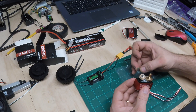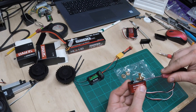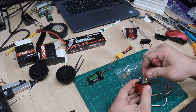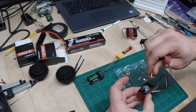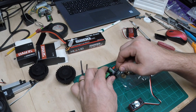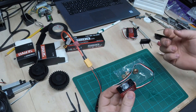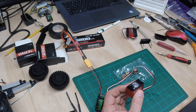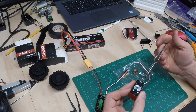I'll take this gear off and set it on the bag, then take this next gear off too. This bearing is just kind of a press fit on the housing for the potentiometer, so I'm going to take it off. Now some of these may have a physical mechanical stop - this one didn't, it can naturally free spin. It's the potentiometer right here that's telling it to stop, go left, right, whatever. I'll plug this servo back in and plug it into power and turn my receiver on. You can see it's on and running - my stick is centered but the servo is moving because the potentiometer is not centered. Once you center the potentiometer, the servo will stop.